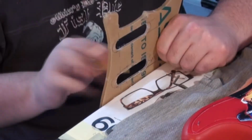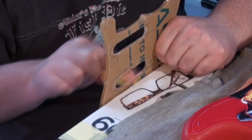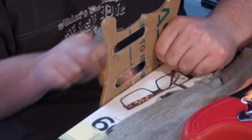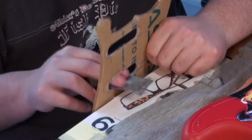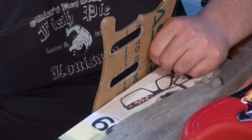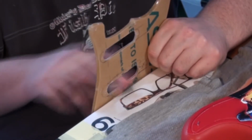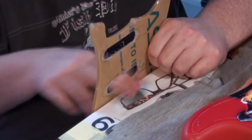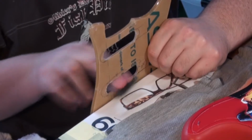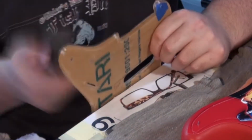I felt that the final sanding and polishing needed to be completed before gluing down the design. This would have been 250 or 300 grit paper to remove the scratch lines from the sanding with the 150 that I used to remove the Dremel and file lines. At the time I debated if anyone would even notice the condition of the inside of these pickup holes, but it is a clear pickguard after all, so you are going to be able to see through it to most of its edges.